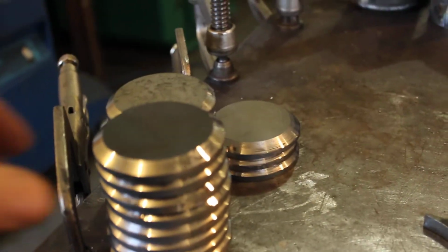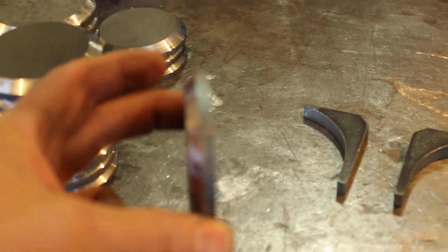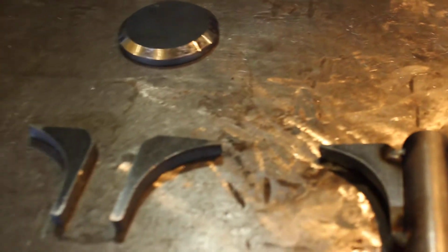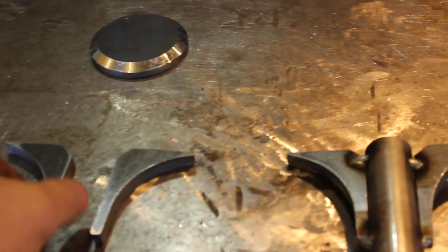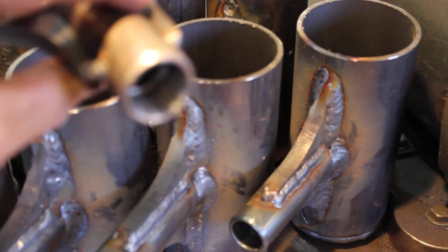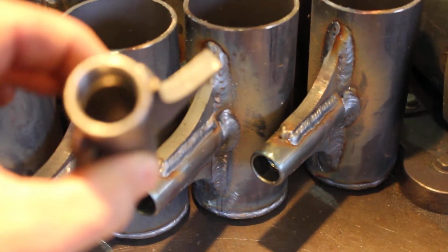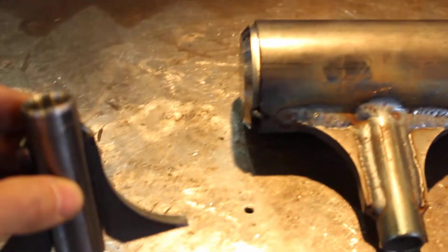These are our face caps. Now these are 3/8 laser cut slugs, and that's what we use. We use an all welded construction on our head tubes on all our hammers, including our handheld series. We have laser cut slugs also out of 3/8 plate. These will get all welded together in a little jig to make up our neck tube assembly. I don't know if you'll see it here, but there is an O-ring groove machined in each end. We don't use O-rings, it's just to interlock the urethane into the neck tube and bond our handle in.